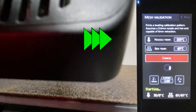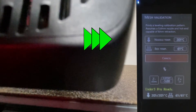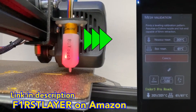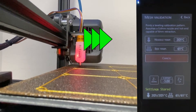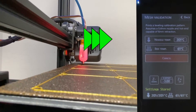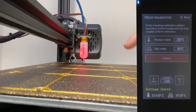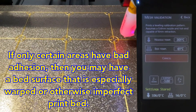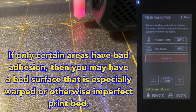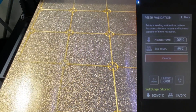This firmware was designed for the Ender 3 Pro, but it works on the Ender 3 V2 if you have the 4.2.7 board. By looking at the pattern and seeing what parts of it are bad — if they're not all getting good adhesion, then you can lower it a few more steps, or raise it if it looks like it's squished too much. Here you can see the pattern is getting pretty good adhesion across the board, so I'm going to call this good. If it looked like parts weren't sticking, then you might want to lower it a few more steps and try again.